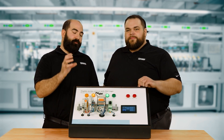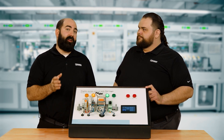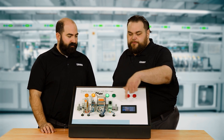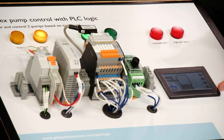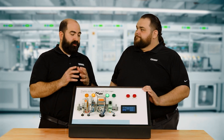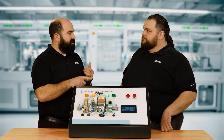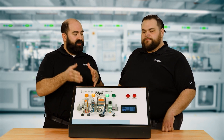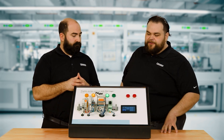It's incredible to have such simple control done in a small form factor right on top of the bank of relays. The best part is we can leave it as a standalone application, or we can look at that data via Modbus and display the values and output states of the logic module in real time. So not only does it do local control and logic, it also has communication elements — RS-232 and RS-485. That's what we've got here with our basic touch panel HMI.